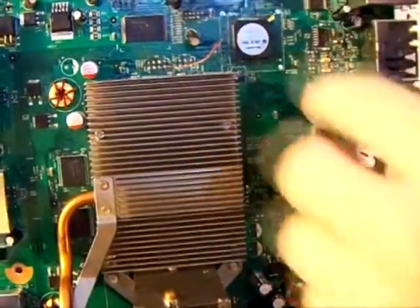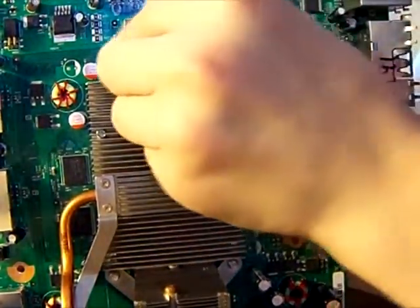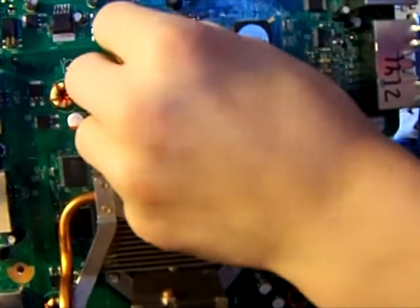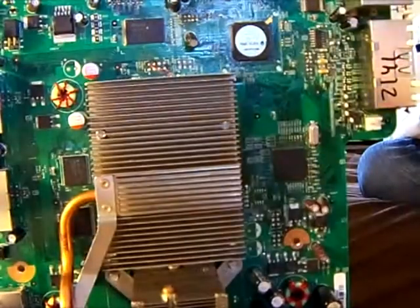Then you want to solder the other end of the wire to this third point. Move the wire over — you've got it there — now make it to this one. Solder that end to this one right here. Get the wire, put it where you want to solder it, get the soldering iron heated, and push it in. You just bridged the connection. You can see it's going from the first one to the third one — that's the same with all motherboards, I'm pretty sure. Alright, so we're going to do the other portion of the JTAG point.